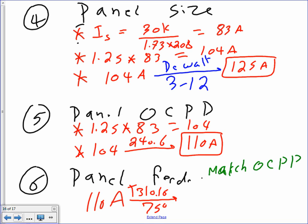Number 2 is actually right. So how many conductors though? I'm going to write number 2 AWG THHN. How many conductors? Okay, we need three for the three phase. On the secondary side of a transformer, you have a neutral that we use all the time. Since the panel is a baby one, 200 amp or less. Remember how we said if it's 200 up to 300 amp, full neutral, no question asked. So how many conductors do I need here? Four, thank you. Why four? Three phase and a neutral. Gentlemen, that's all I have.